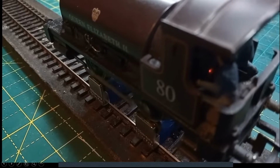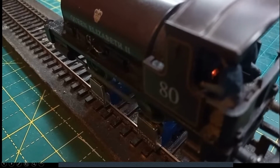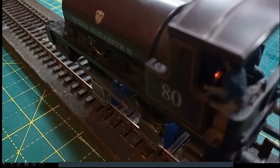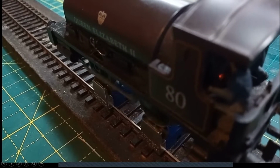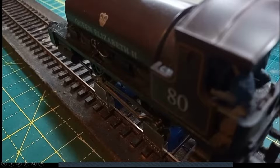You'll notice that the loco has to be running before the firebox will illuminate, and that's simply because the LED needs to have just under 3 volts from the track to illuminate, and 3 volts will of course have the loco running. You can try experimenting with the 3.3K resistor by reducing it slightly. That may help to bring on the LED slightly sooner.